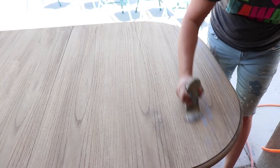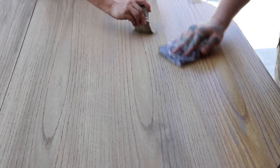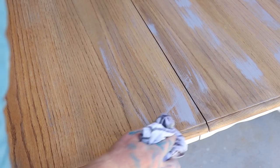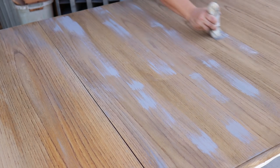I'm going with the wood grain, getting just a little bit of paint on here, and Zeb's going to follow behind me with a damp rag to blur the lines a little bit. Because the Real Stain is still wet, I may activate it a bit, so I'm making long continuous strokes across so I don't get any weird discoloration if I stop in the middle. We're going for variation in tones — this should all be nicely blended when done. Anywhere that's specifically damaged I'll go heavy on that spot to really cover it up.